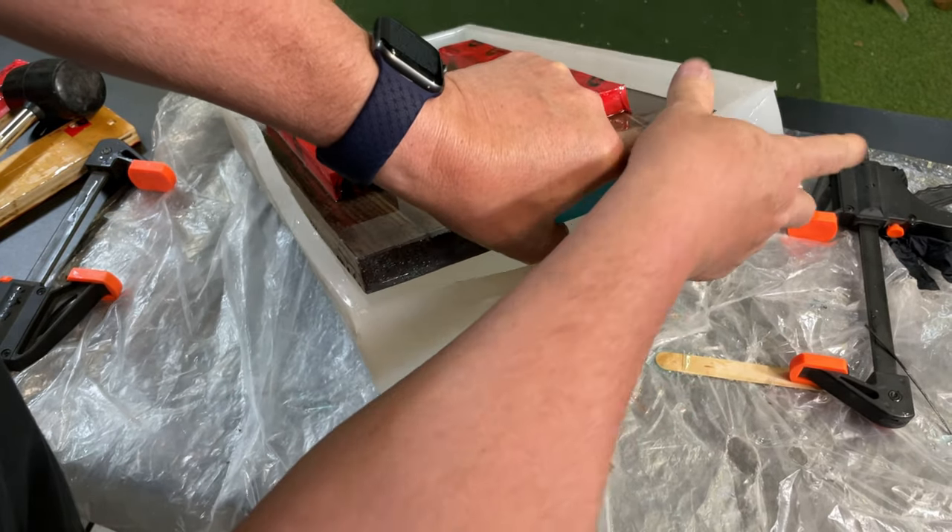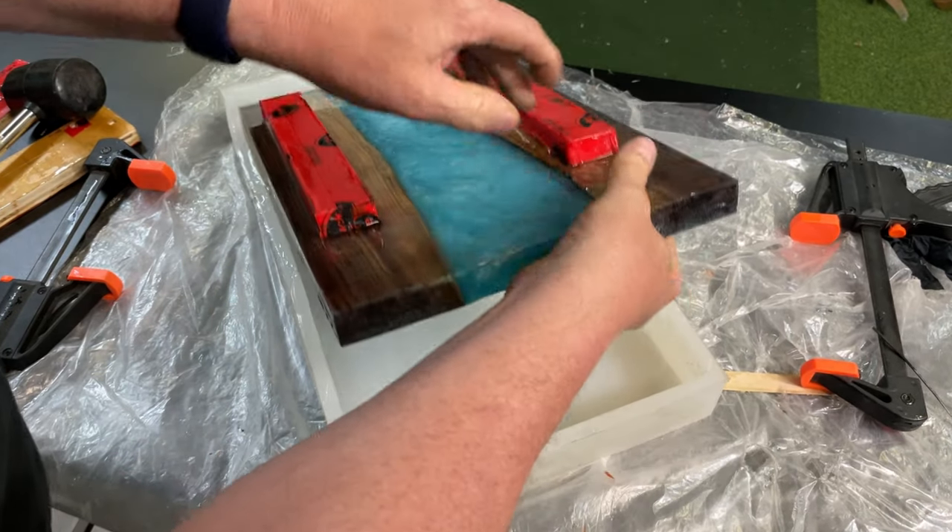This is actually two days later. We pull off these pieces — sometimes you might need a hammer, they can stick. I have them covered in red plastic tape, which helps reduce sticking. Then we pull it out of the resin mold I created specifically for this purpose. If you're interested in these molds, leave a comment. The alternative is to take some plywood and create a box that shape, screw it all together, and tape it really well with red tape or Tyvek tape — the challenge there is you have to take it apart every time and re-tape it, which was wasting me an hour each time.